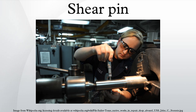Another use is in pushback bars used for large aircraft. In this device, shear pins are frequently used to connect the head of the tow bar — the portion that attaches to the aircraft — to the main shaft of the tow bar. In this way, the failure of the shear pin will physically separate the aircraft and the tractor. The design may be such that the shear pin will have several different causes of failure: tow bar rotation about its long axis, sudden braking or acceleration, excessive steering force, etc. — all of which could otherwise be extremely damaging to the aircraft.